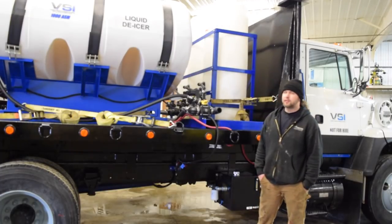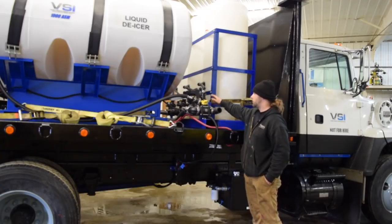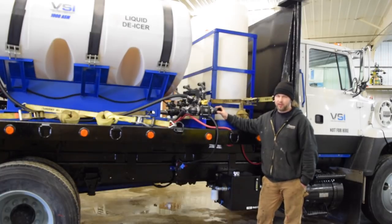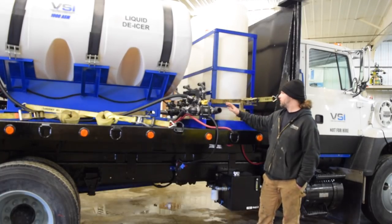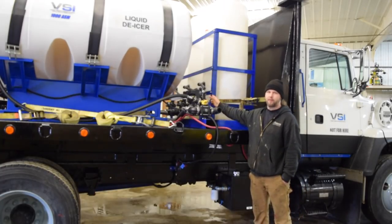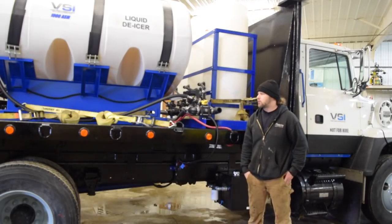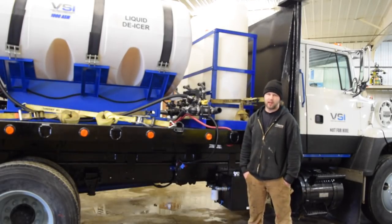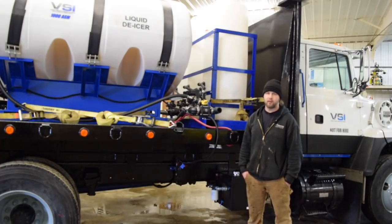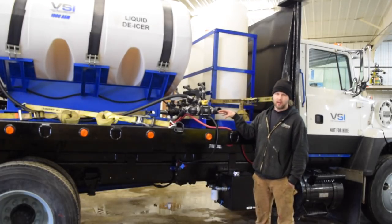Here's a better view of our test tanks. You can see we have a valve manifold system and electric valves on the tanks themselves. There was a tremendous amount of wiring that went into this truck. When we switch a tank on, a bypass valve has to open up for every suction valve that opens, so we bypass back into the same tank. This is really important so we don't get cross-contamination between different products or accidentally overflow a tank that isn't supposed to be bypassed into. Every tank is fully isolated from any other tank on the truck.